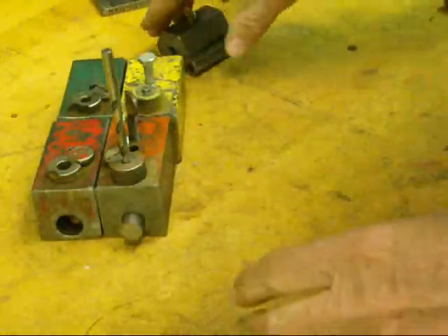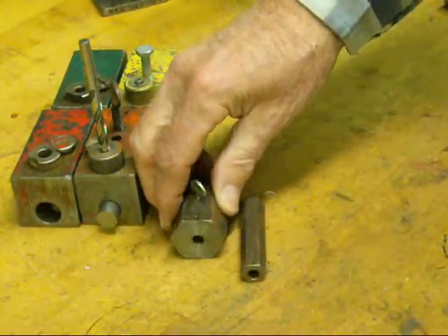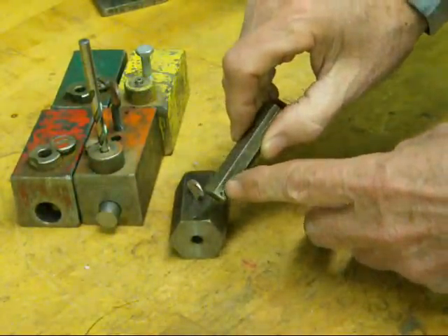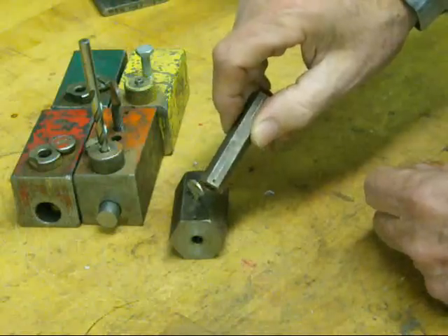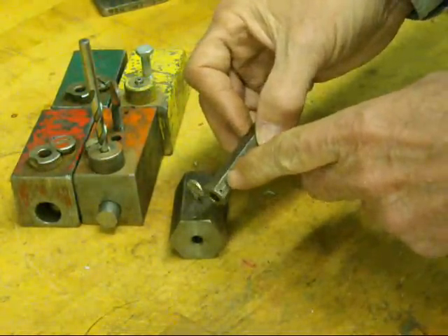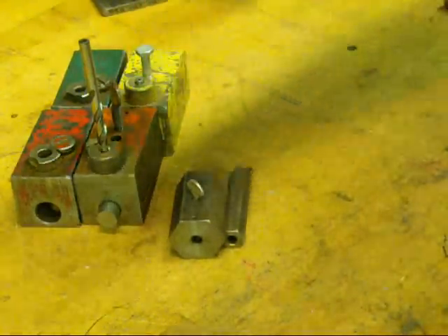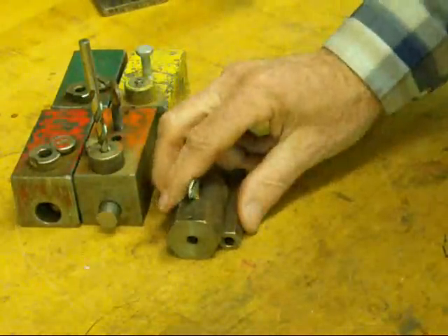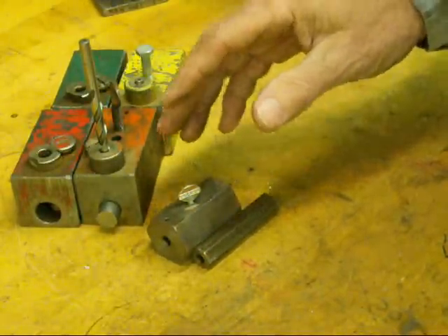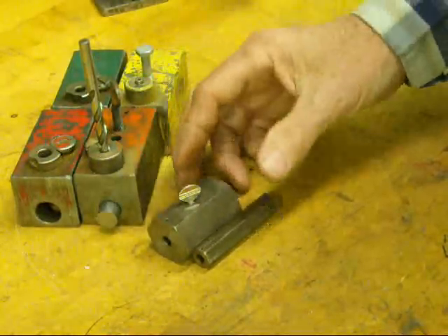I had made those student proof. Here are some other smaller ones I made for home use in my models. This one held quarter inch stock and allowed me to drill a sixteenth inch hole. These weren't hardened, but you're just making a few parts and they work just fine. Otherwise that hole will wallow out on you eventually. But not to worry for minor problems — sometimes it's worth it to take the time to make something like that. If you've got a lot of time invested in a particular part, you hate to spoil it at the last minute.